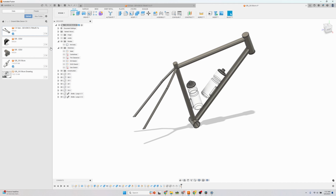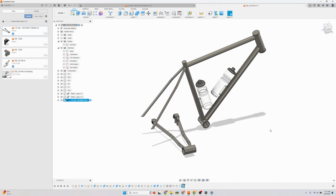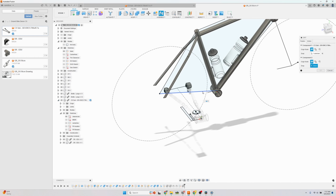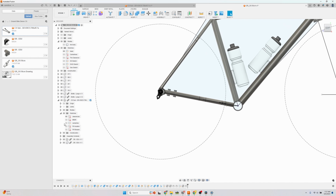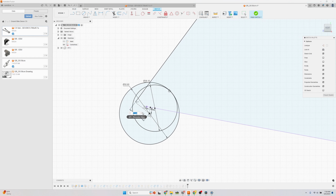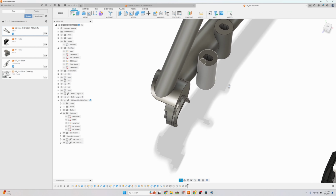And so if I drag in the drawing that I created earlier, and then I'm going to join it to the sketches, hit join, and there, click OK. Let's see. Now you see the chainstay subassembly is in the CAD of my gravel bike, and we could tweak it a little bit here. The seat stays are a little bit too far back, so let me edit the sketch, pull these in, 12mm offset. That looks pretty good.